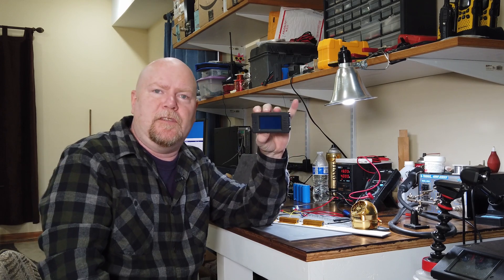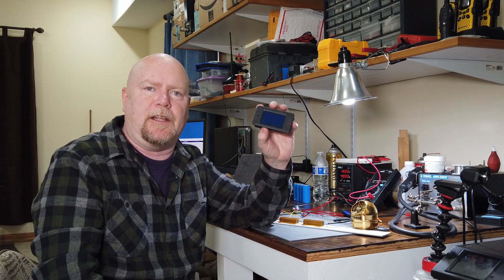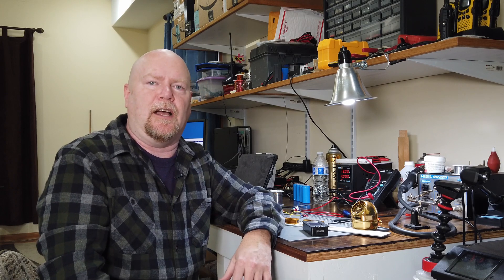Here's what I'm trying to do. I don't know if you can see that in the glare or not. This is one of those $10, maybe $15 cheapo Chinese power meters that you can wire up to determine how much voltage is left in a battery, how much current you're drawing out of it at any given time, and because it knows those two things, it will calculate the power draw, the energy draw, the state of charge of the battery, all kinds of good things — assuming you tell it what kind of battery you're starting with. It is only a discharge monitor.